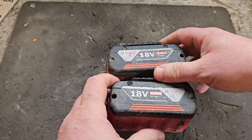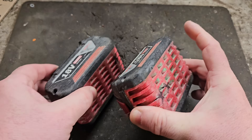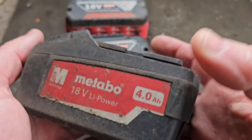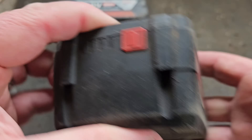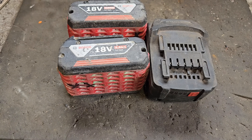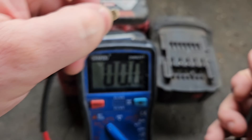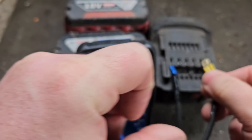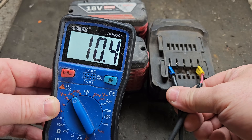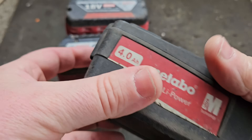We'll have to start with something simpler. One of these 4-amps needs two cells and the other needs four, so I need six viable cells total. As luck would have it, I've got this Metabo faulty battery — I think it's a 4-amp but I think I can salvage enough cells from it to fix the other two. A voltage check shows 10.5V, and with a 10-cell pack that means it has at least six viable cells.